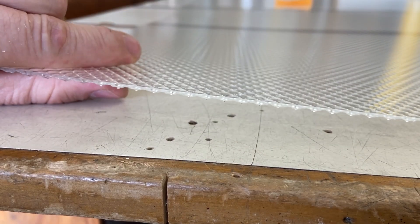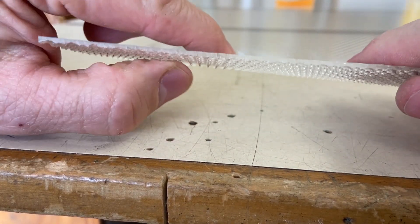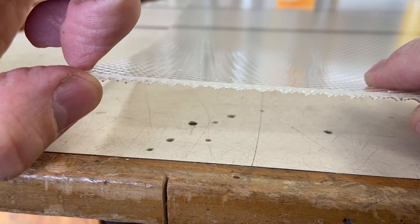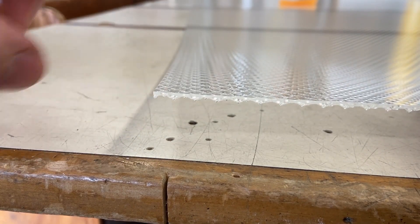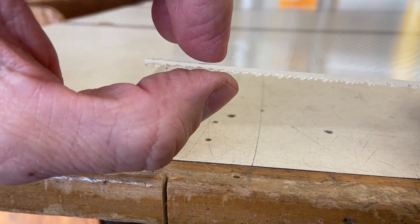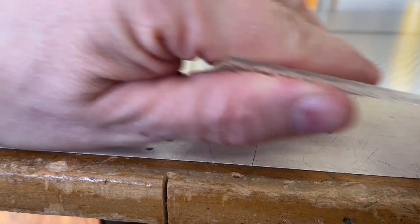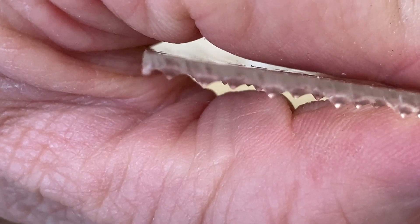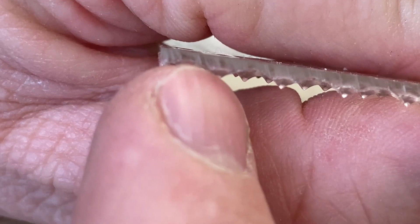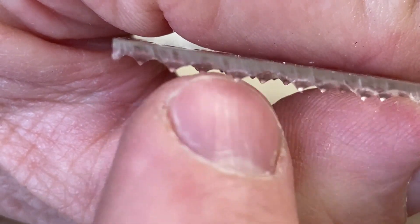One last item to point out is that the two sides of this particular material are dissimilar. One side is smooth and the other side is textured or dimply — this is where you can see the plastic ridges. It was cut in a way that the rotating saw blade started the cut at the top on the solid surface and finished the cut — or the chip formation — on the dimply side. So should any cracking start at the top, the possible chips that form are all hidden between the zigs and zags of the material.